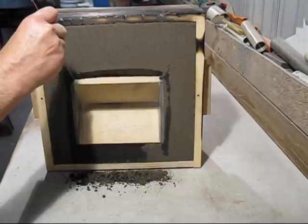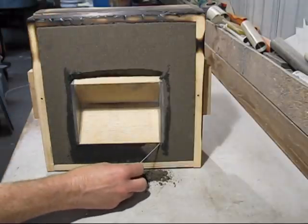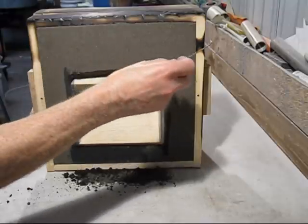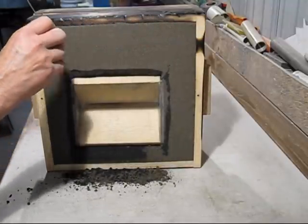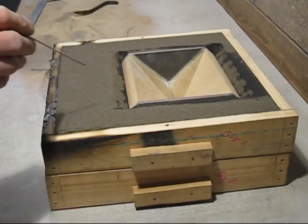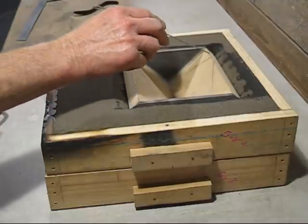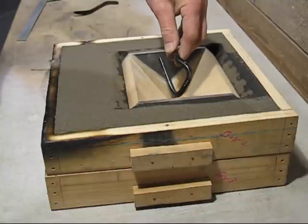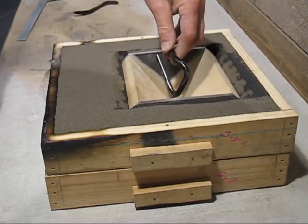Go around here. And then around to the bottom. And just keep going until you're finished. All the parting lines are trimmed to the correct place. I say that tongue in cheek because I never get it perfect. The next thing I have to do, I have to put a bit of reinforcing in here so that large lump of sand doesn't drop out on me.